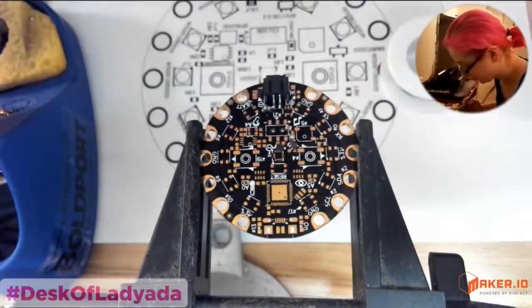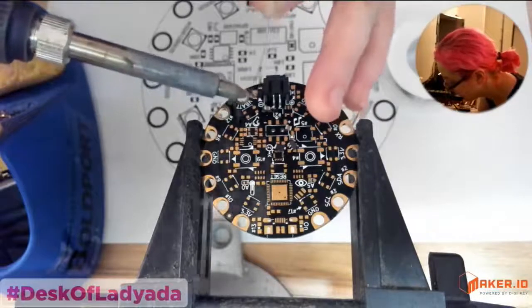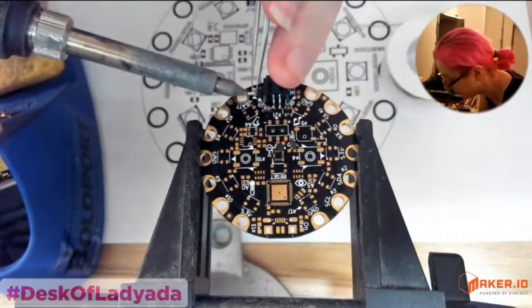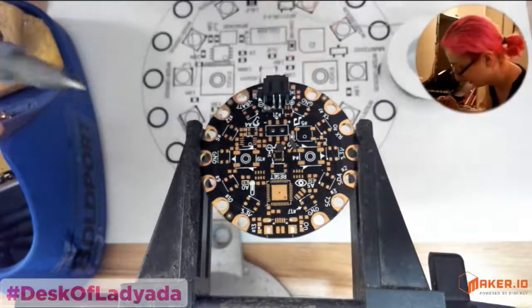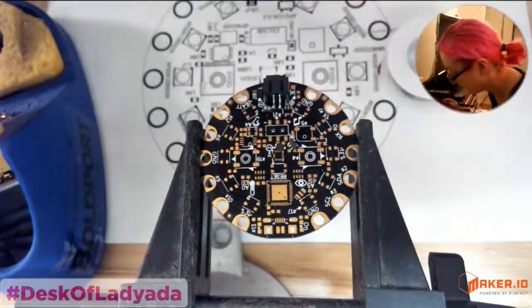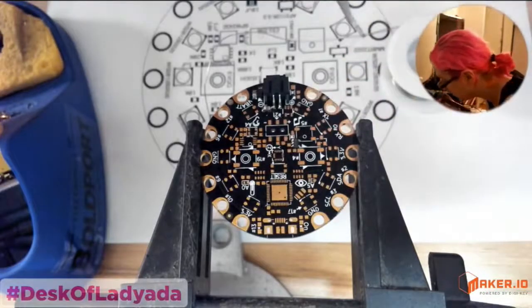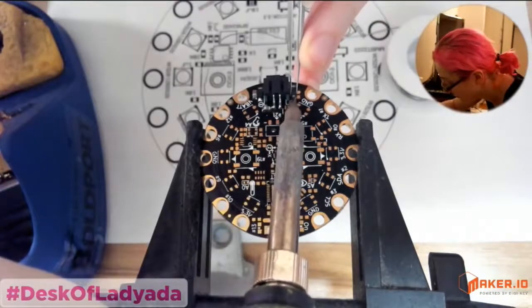It's actually quite difficult to buy non-RoHS components these days. The only time is, we were talking earlier about how I wanted to use a photocell, and photocells are no longer RoHS. You can still buy them, but they are not RoHS certified. But even if you're not planning to go to Europe, it's inevitable that American companies and retailers will eventually want RoHS only. Or you never know, you might end up having a popular product and you want to send it to Europe. You're going to need to provide RoHS certificates for all of your products. Kind of inevitable.